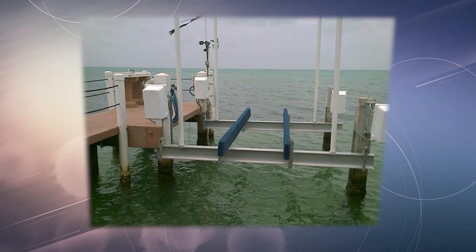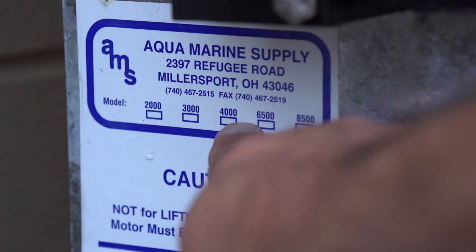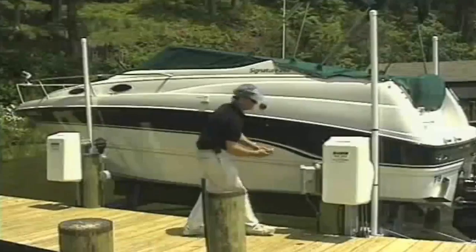Inspect the piling alignments for anything that can cause extra stress on the gear. This stress creates added torque and can damage the unit. Check cable winder and pulleys for misalignment that can cause added stress on the gear. Cross-reference the weight being lifted by the unit to the weighted capacity of the gear. If the weight being lifted is in excess of the rated capacity, damage can occur.